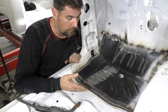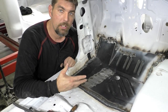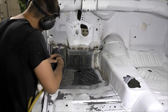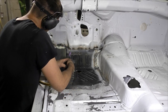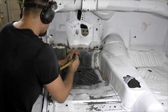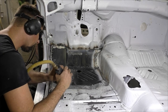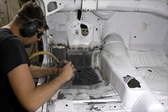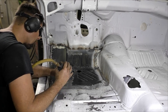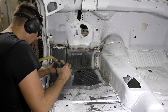All right, you can see we welded it up. I've got to fill up a hole and pull that screw out, but for the most part we're wrapped up. I'm going to start cleaning and fine-tune to see if we missed anywhere welding. The cleanup process is going to be the same as earlier — I'm going to use a belt sander with an 80-grit on it. You can use a grinding disc, a surface prep disc with different varying grits working your way down, or a combination of all. I know on the area where we did the little burst welds, I used a quick grinding stone just to knock down the high spots, then coming back through with the belt sander and fine-tuning everything. I personally like the belt sander because when the whole project's done and we put our epoxy on it, it really does hide the 80-grit scratches.